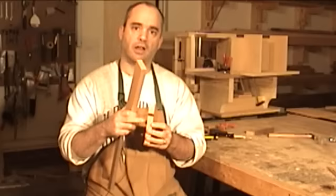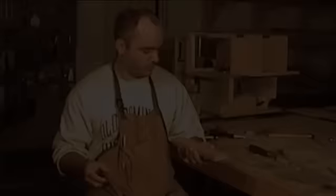The body of the plane is made from three-quarter inch thick cherry, and in order to keep the plane from splitting in half when you create the slot for the chisel, you need to glue on a piece of wood onto the side — in this case, I chose a half-inch thick walnut. I already have my cherry and walnut milled to thickness, so the next step will be just to glue these two pieces together.